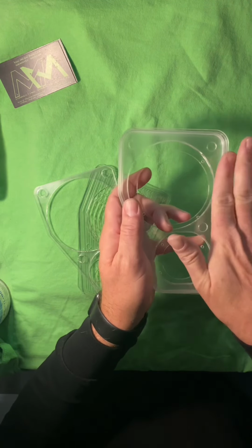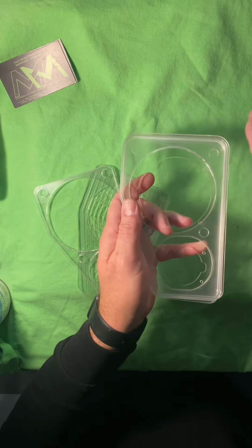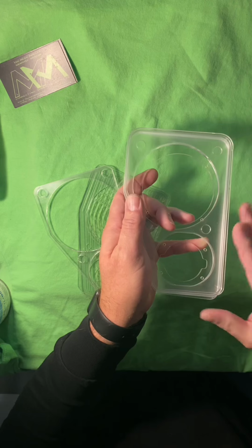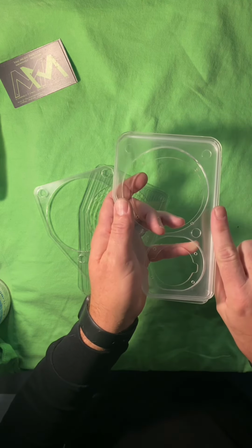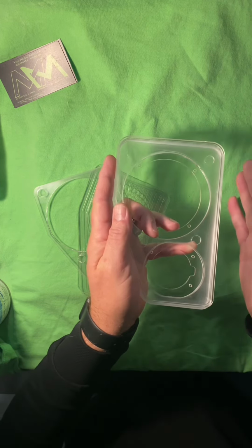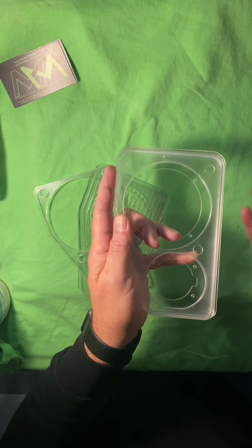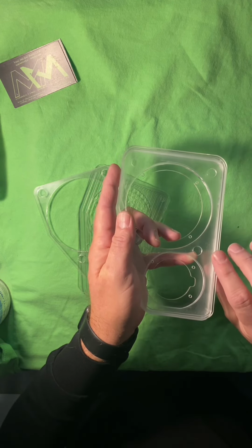So you're going to have material coming to the edge. You're going to scuff this edge, pull this back to the pillar in this case, glass it, fill it, whatever your process is, sand it smooth. So you've got material laying up on top of this now. So that's added just a little bit of material. And then you're going to typically wrap it. And because you're going to wrap it with the material anywhere from, you know, suede to vinyl to leather, it's going to add a little bit of height on this ring.